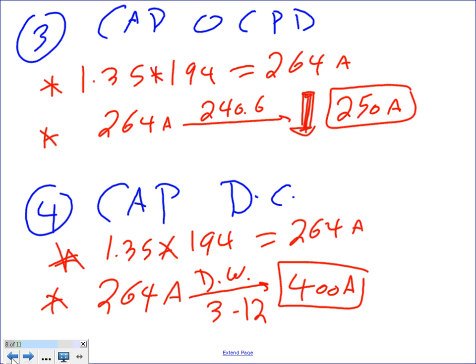Then, when you get to 50, sizing the disconnect, the overcurrent protection device and the conductor for the motor becomes like any other motor. We know how to size a disconnect, a fuse, a conductor and an overload for a motor. We've done that many times. They're not capacitors, they become a motor. So you treat it like a synchronous motor and you size the conductors at 1.25, overcurrent protection device 2.5, disconnect 1.15, overload between 1.15 to 1.25, depending upon the temperature rise and so forth. Any question about capacitors?